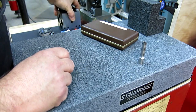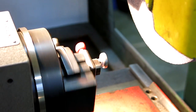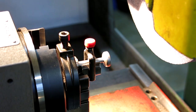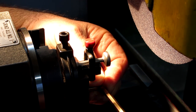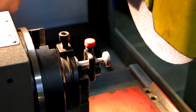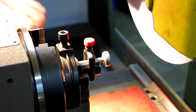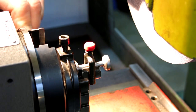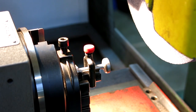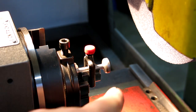Let's go drop that in the whirly gig and give that a little spin job. We got that in there and you can see it's pretty far out, so let's dial that in. First we'll lock that and loosen the V-block. Let's get it back and rotate. It's high right now, so I just kind of do a little eyeball centering until it's looking pretty good. Then it's in range of an indicator, so I'll get an indicator up in there and we'll dial that sucker in.